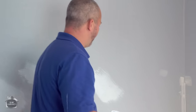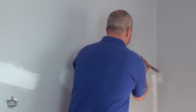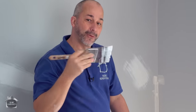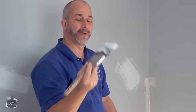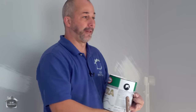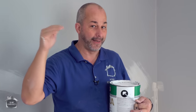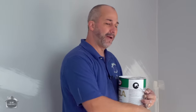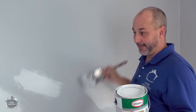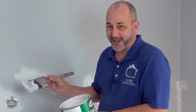Flashing is the painter's enemy because whenever you have flashing after two coats of finished paint, you can't just go along with the brush after and touch it up because that'll show too, because you're leaving brush mark instead of roller mark. You can't just go by with a little mini roller because acrylic paint, after it's been sitting for a little bit, the levels of acrylic are different from the beginning to the end. So the only way to make a nice wall when you're painting is to paint the whole wall, top to bottom, the whole section. So you can't do touch-ups on flashes.